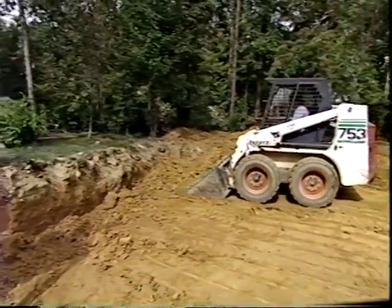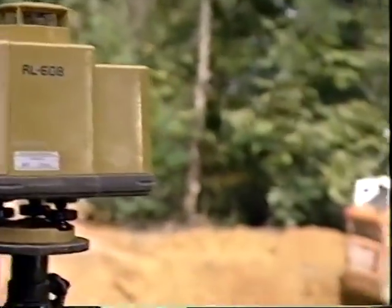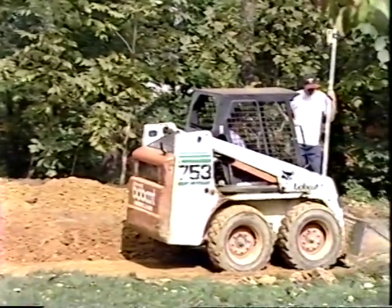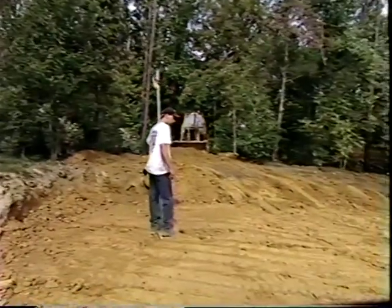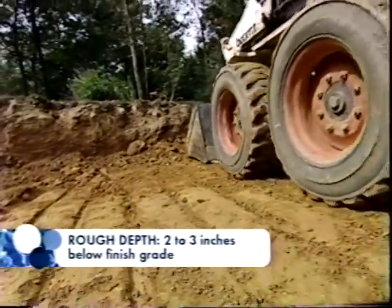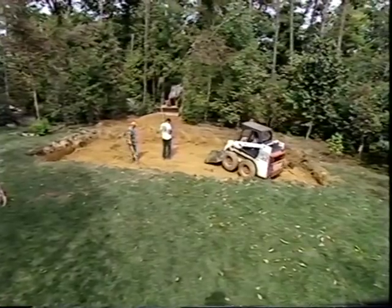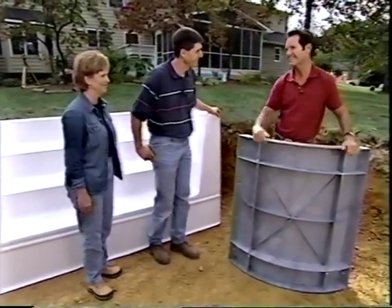The panel shelf must be level all the way around the excavation. The shallow end also needs to be 42 inches deep — this is the finish grade depth, so the rough depth should be two to three inches below that level. Again, we have to be sure we don't over-excavate.